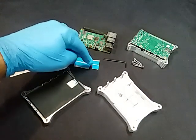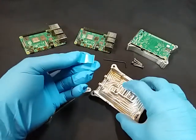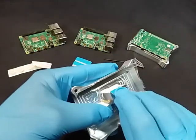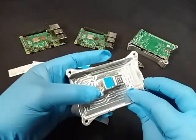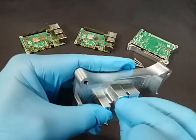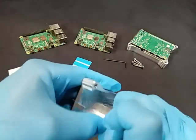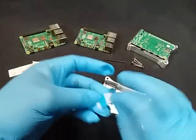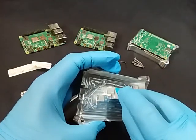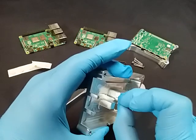So what you need to do is cut a piece of your thermal tape right across for two pieces, and we need to put two pieces of this on that middle pillar. After you get some pieces cut, simply peel one up and put it on there, then peel that blue portion off and take your next piece of thermal tape. I couldn't find the thermal tape exactly the right size, so using two of them will work just fine.